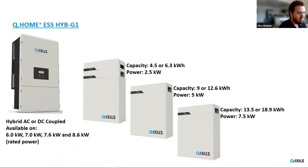There's quite a bit of granularity with the solution you can offer depending on the application and what the homeowner wants. One thing to note: on the first battery unit, the BMS module is attached — and there's only one BMS module even if you have three batteries. That one BMS module controls all three batteries, which ultimately reduces the wiring necessary and possible points of failure.